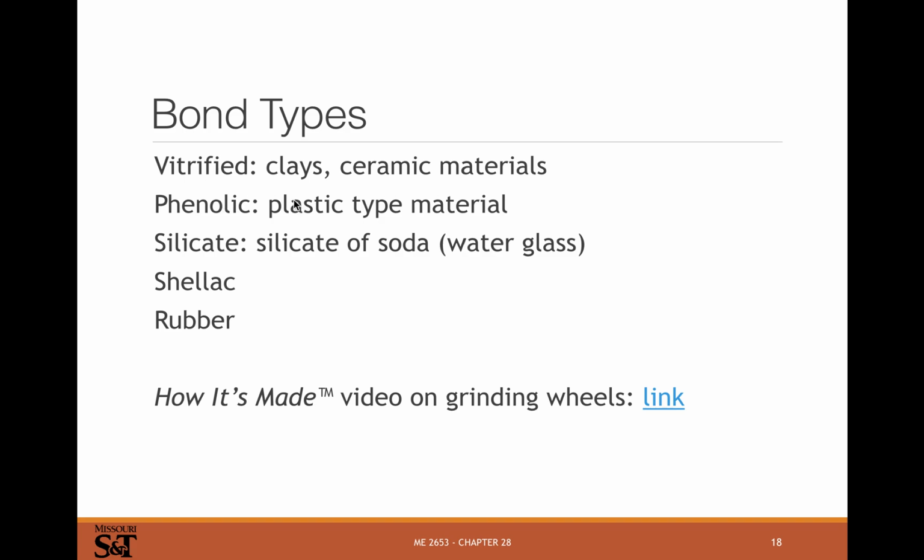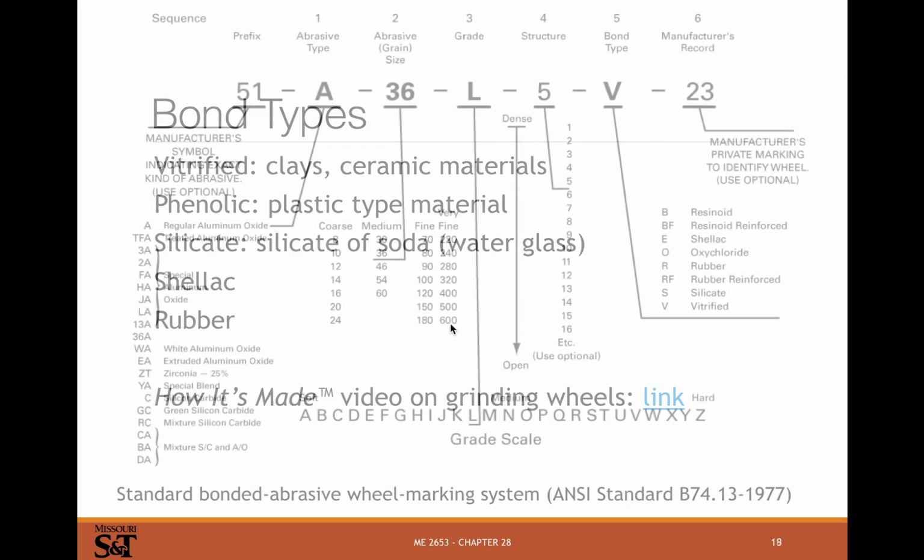Bond type, vitrified. This would be some kind of clay or ceramic materials holding the grits together. Phenolic, it might be some kind of a plastic type. Obviously, that would be a softer grade, and these would be more of a harder grade. Silicates, shellac, that would be pretty soft. Rubber, that would be very, very, very soft. Again, I'll post these links in the description below for how it's made on grinding wheels.